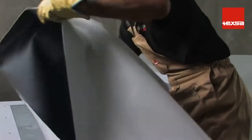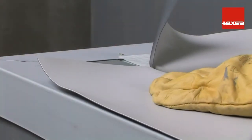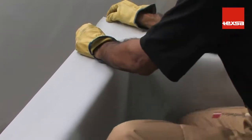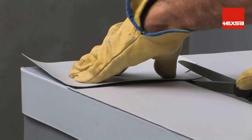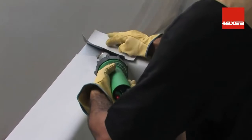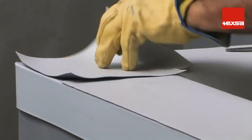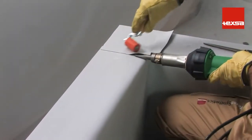Place the membrane on the wall and cut along the vertex. Weld the membrane to the flashing strip, making sure that the fasteners are covered. Cut a piece of the same membrane to cover the entire surface, make a notch in the vertex coinciding with the corner, make a spot weld in the center to hold the piece in place, and weld from the center outward avoiding the formation of air pockets. Press down with the silicone roller, taking special care with the joints.